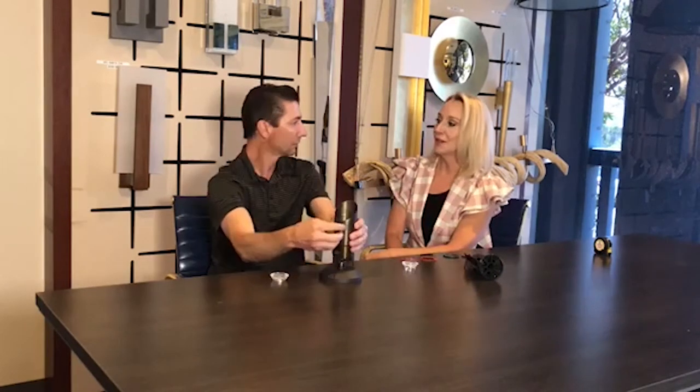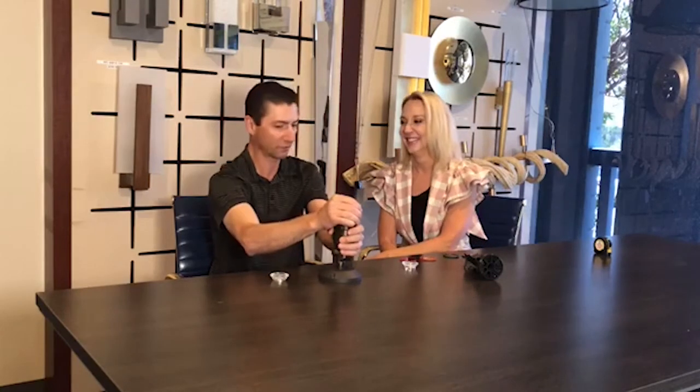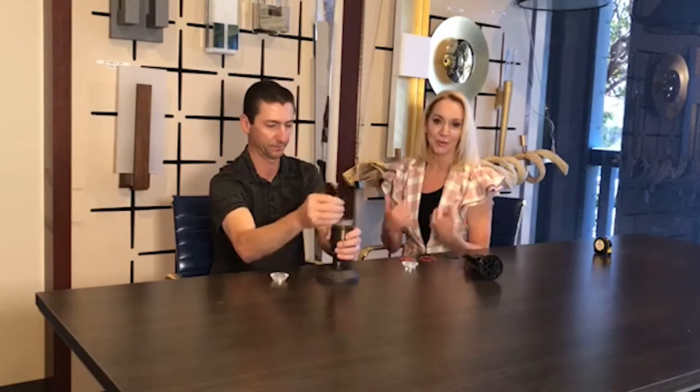You get hit with a lot of questions like, 'Which bulb do I get? Which beam spread do I desire?' I had a conversation about that just this morning. How nice is it to have the freedom to relax and say: 'I've got a dozen of these in my yard — I need my palm trees lit up, so that's a 15 degree. I need the bushes lit up, that may be a 40. And if you want a broad graze for a wall feature or wall texture, that would be 60.' You wouldn't have to panic that you purchased the wrong bulb — it's all in one.